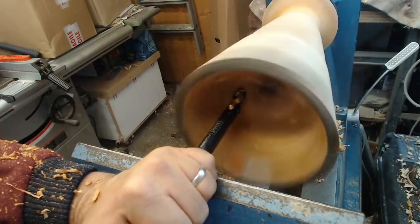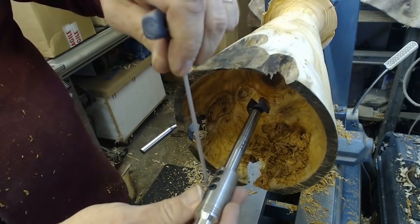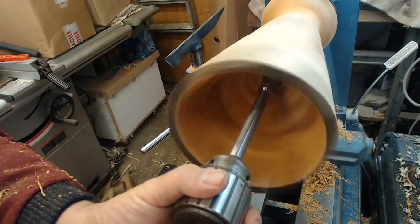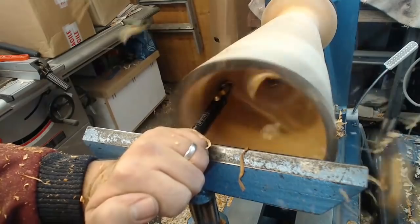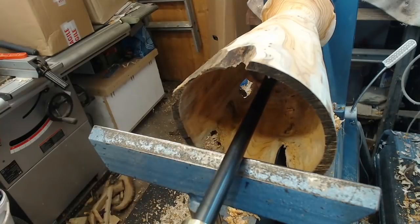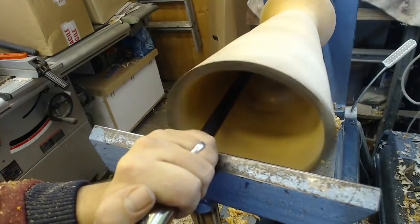You can make your own wooden extension handle to go on. As you can see, I'm probably about 4 inches in at this point; in the end it ended up at least 11 inches deep. For every inch over the tool rest, the formula I'm told is 4 inches behind it. Once I got the first half hollowed I was able to put the Forstner bit back in with an extension so I could drill down to the bottom to the final depth, and then continue hollowing. I'm still a beginner hollower, I would have to say, but I was pleased with the results. I have got Simon Hope's hollowing rig to have a go with, so I'm looking forward to playing around with that sometime soon.